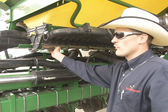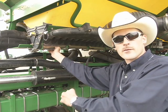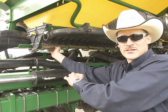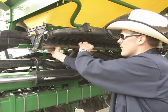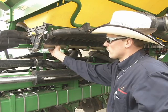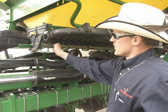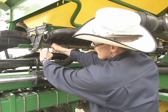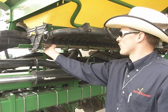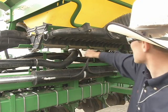So you can hold it shut while somebody else gets another bag or another bucket with a 2-man operation. But if you open this, there's no way of shutting it until gravity stops the flow, and you can clean this seal and then shut it. You push it up and engage this little lever into this slot and slide it over center until it's locked and firmly in place. And do the same for all of them.